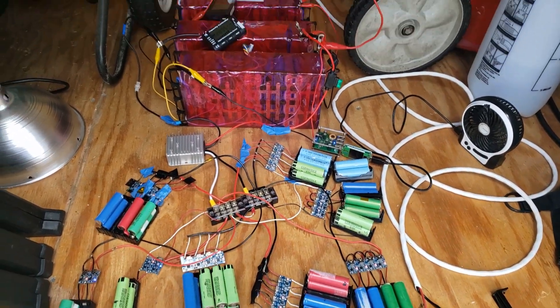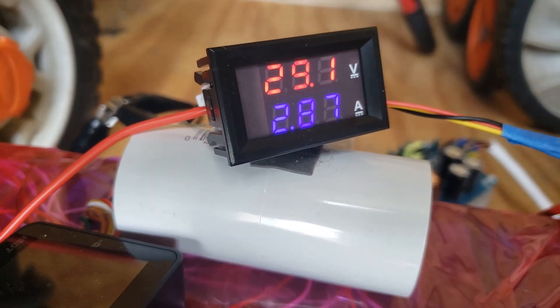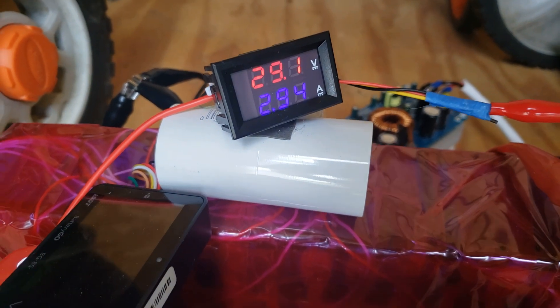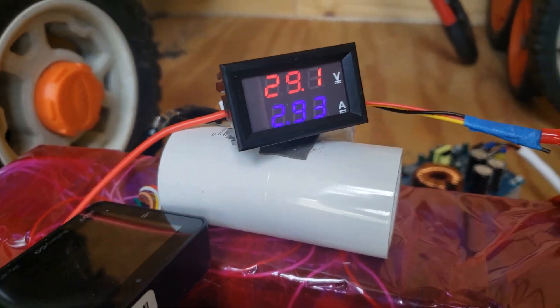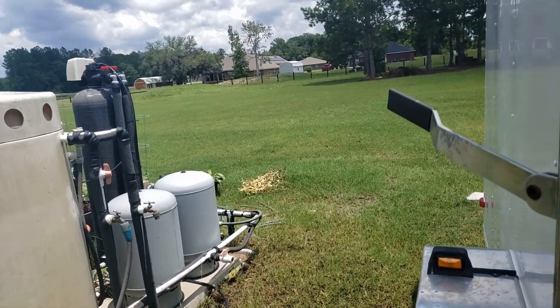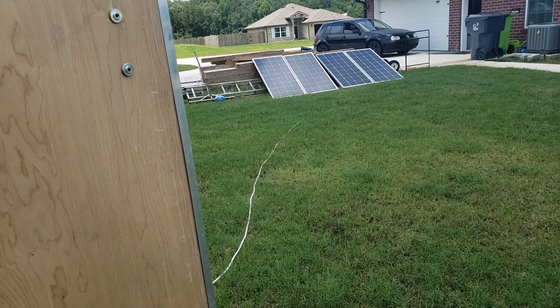Here's my little setup — three kilowatts worth of battery power. I have the limit set on that buck converter down there to 29 volts — it's just one of those blue square potentiometers, so it might be a little sloppy, but it's set at 29 volts and currently sitting at 2.9 amps. I'm only using 400 watts worth of panels today, but they'll usually do about 10 amps together at 24 volts on a good day.